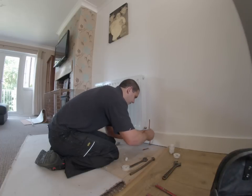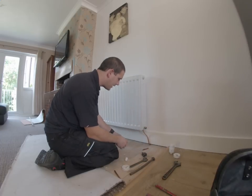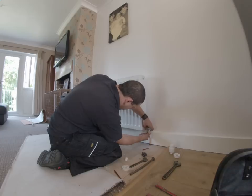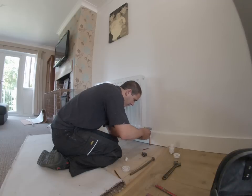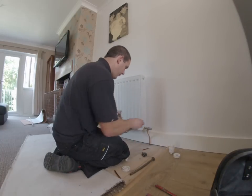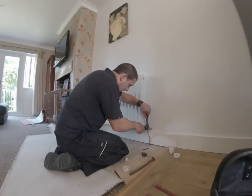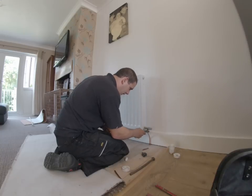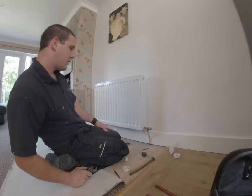Cut that. As you can see, there's a nice clean finish. That then goes into the valve — make sure that's pushed fully in, onto the radiator. Now what you need to do is tighten those up, give them a bit of a nip. Always hold against yourself — otherwise you're likely to spin the valve and kink the pipe. You don't need to overdo it, just hand tighten it now. That's plenty. Keep that nip on it. Check it's straight. Perfect.